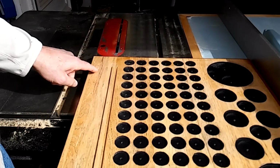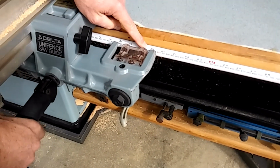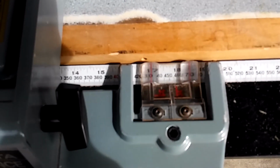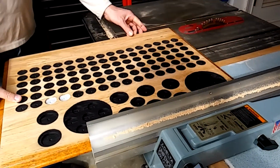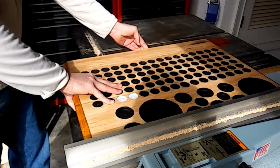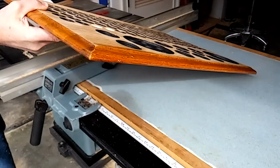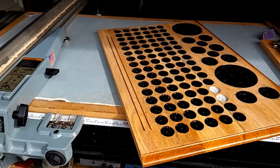As the saw cuts, the best edge is on the top, and then the blowout is on the bottom. We can sand off the blowout. Over here to my vernier. Find our 18.5 mark. And you have to look straight over so you don't have parallax. You got to look straight on. Okay. Going to raise the blade all the way through the cut. Size. It looks good.